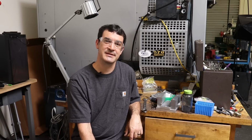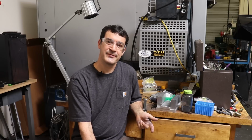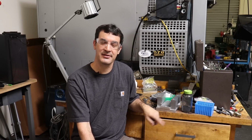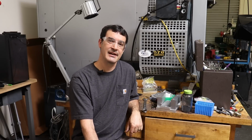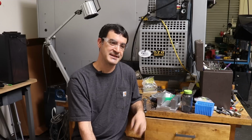And I'm going to pull out the follow rest, which I purchased for the lathe maybe 5 episodes ago, with anticipation of potentially using it on Keith's project. The follow rest that I bought was, I think, for a later version of the lathe than I had, so I actually have to machine out a clearance area for some sheet metal on the x-axis. So I'll show you quickly how I did that, and then we load the follow rest. And then we'll do a little bit of work with the tension and the accuracy of the bearing on the live center. I actually had to switch back to a live center where I could adjust the tension.